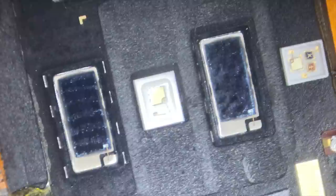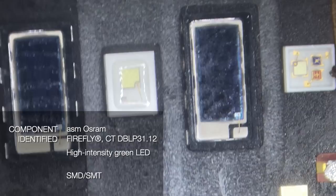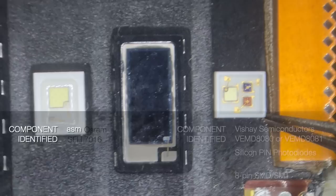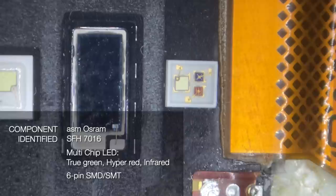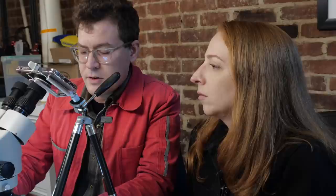This is the underside. The main part here has the actual sensors that determine your heart rate and blood oxygen level. You can see there are actually two LEDs and two photodiodes — the transmitters and receivers. There's a high-intensity green LED and a photodiode, plus a package that has a red LED, a green LED, and an infrared transmitter. You can see all three of the die wires there. Your blood transmits light differently depending on how much oxygen it has in it. It's a pretty elegant little sensor — it really doesn't cost that much, but it has very high precision.